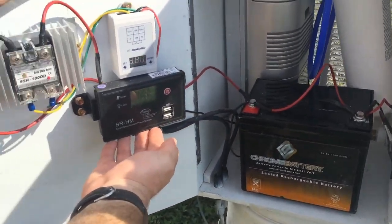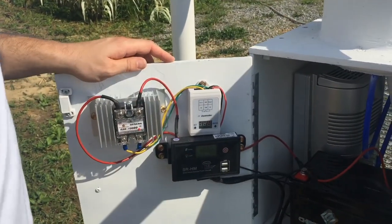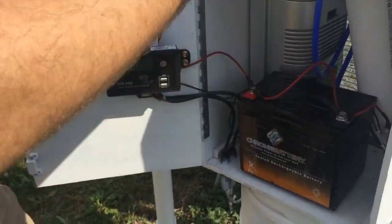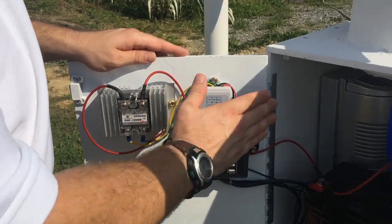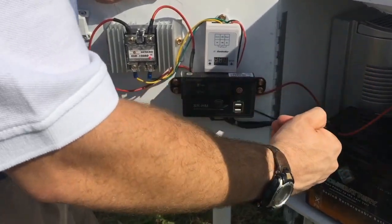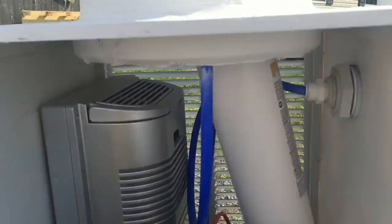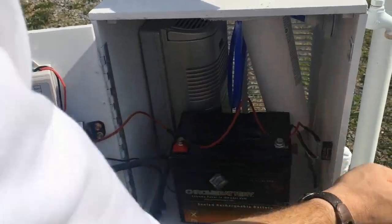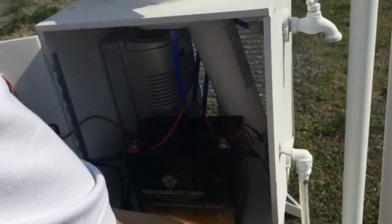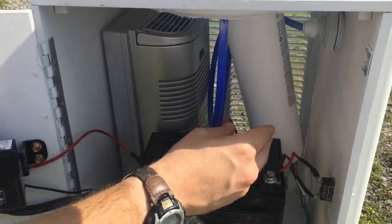We've got our solar coming in through a charge controller. When it comes to EMP, the reason we went with an 85-watt solar panel is with the load we have and the battery to buffer it — worst case scenario, EMP fries everything — you still have the option that the solar will carry through the battery and charge the DC unit. This has a solid-state relay that will run the dehumidifier up to a cutoff point, giving long life to the battery and letting it run late into the evening hours when humidity is very high, especially in summer. We also have a 35-amp-hour battery built on board. This dehumidifier unit has been custom fabricated with a fitting allowing it to pass through and drop down into the five-gallon collection so you can see how much water you have in there.